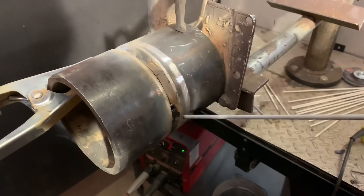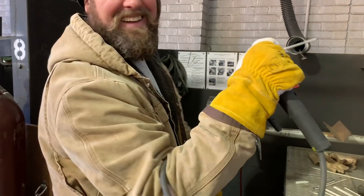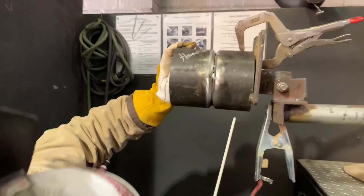One of the tips for the drag method uphill is you're going to have to free up that right arm — or whatever arm you're welding with. You can see how fast this is coming up welding right now — we call that letting a big dog eat. You're not going to be able to do this if you've got both hands on that stinger. My best advice is weld this one-handed. Let the big dog eat. Make sure your angles are right to the center of the pipe with that rod.